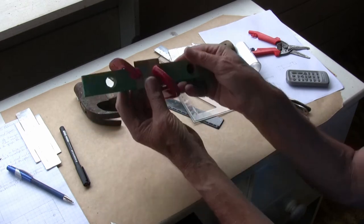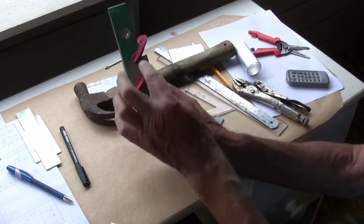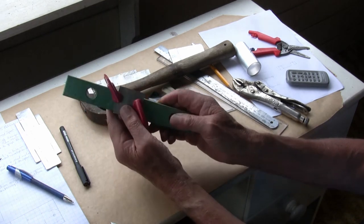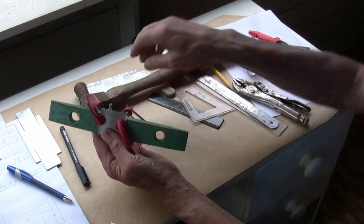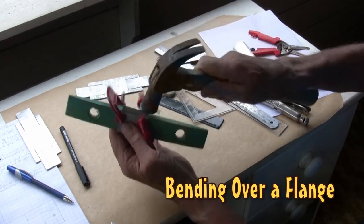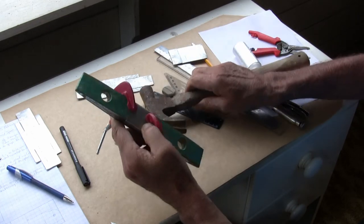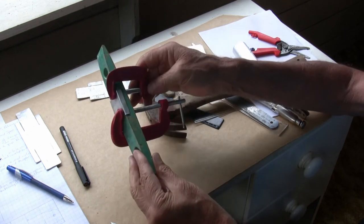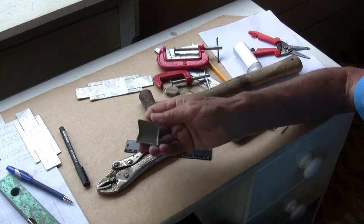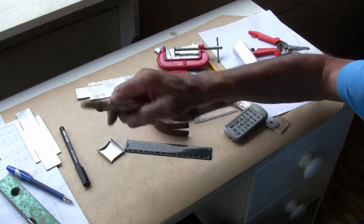Here I've got an old level which has square edges and I've used clamps, and then I'm bending over a flange. I'm also turning over the ends to stiffen the metal using these vice grip pliers.